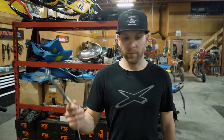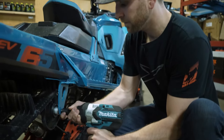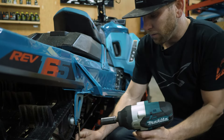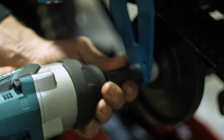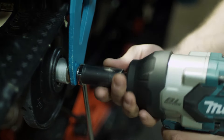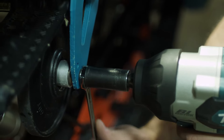I'm going to get Jason to come in here and be my backup for the other side of the skid with the 17. I'm going to start by loosening this side. You're going to see it comes out a little bit, and with my 13 millimeter I put it on the bolt like this and tighten it back up. So with this side tight now, Jason's going to loosen that side and loosen it basically all the way. Now to show you why I have the 13 in there — I'm going to use it to pry, because there's a lot of Loctite on these bolts and there's a shaft inside that spins all the way. So this just puts a little pressure on the shaft and the bolt to let it slide out.